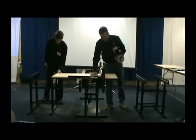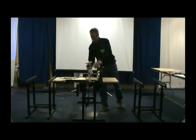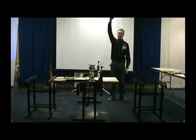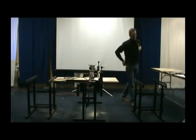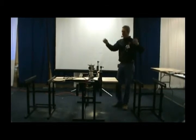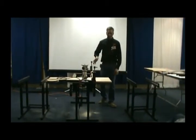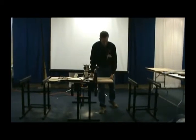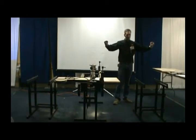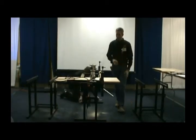Okay, so let's say that we want to build a really nice bookcase. A bookcase is going to be about this high, right? And we want to build it professionally. I mean, we don't want to just stick shelves on and nail them through, because that's really ugly and just not professional. The professional way to make any proper shelf is to dado the shelves right into your side panels. So not only does it hold securely, it looks professional.